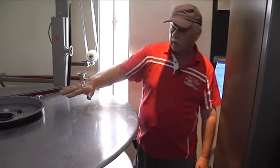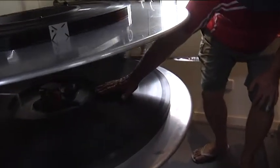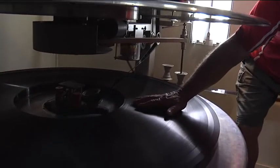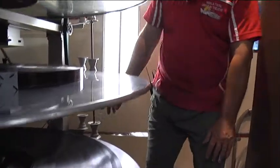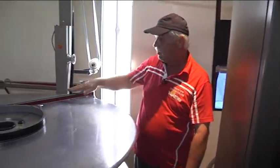What we do here is we're running a 35mm film. Two of them are joined together down here on the bottom platter. A film averages about six reels each — this one is six, the other one is seven. They go from the bottom platter all the way up into the projector, and they come back up onto the top platter.